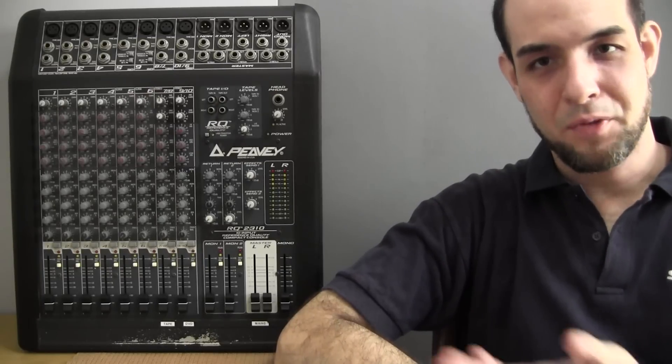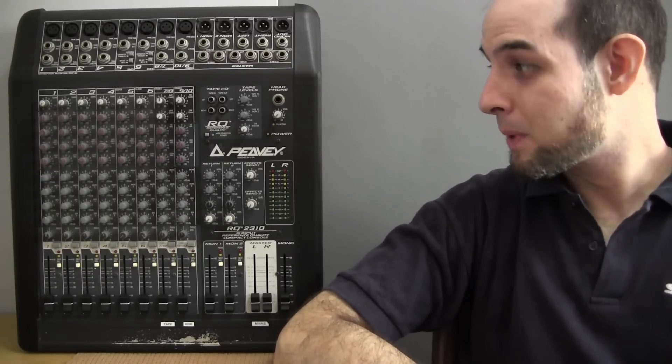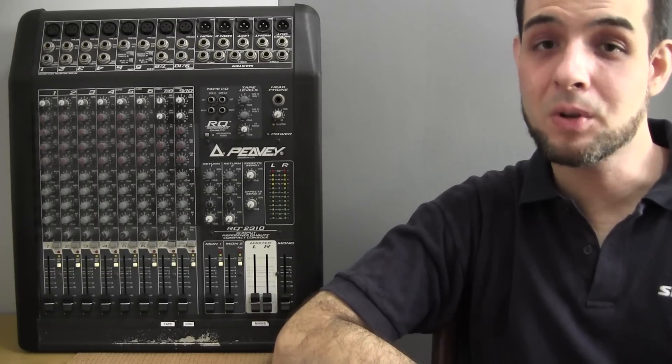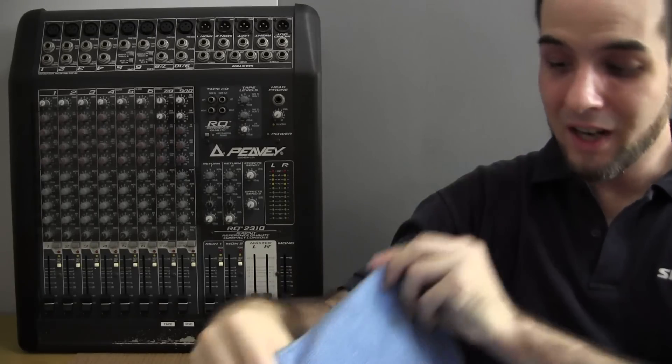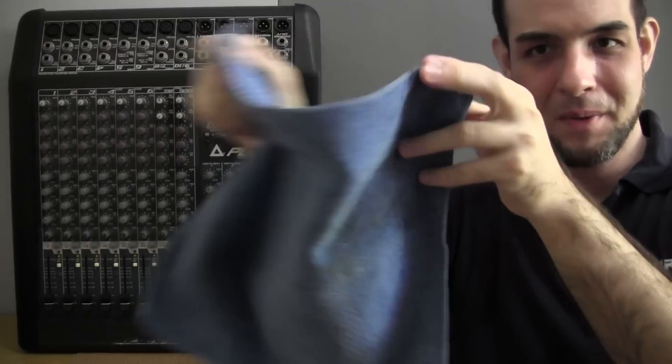So there we are — our finished product. What was originally looking like something dug up from the backyard is now something that could almost pass for a brand new mixer. All you need is a clean paintbrush, a microfiber cloth, and just a little bit of car care product. That's how you clean a dirty mixing console. If your mixer is contaminated with food, water, or beer, it's always best to bring it to a professional for a thorough evaluation and cleaning before using it on the road. But for just day-to-day dust, dirt, and grime, this system works very well. And to prove that I did the cleaning myself — there's our cloth. You can see all of that is what came off the mixer.